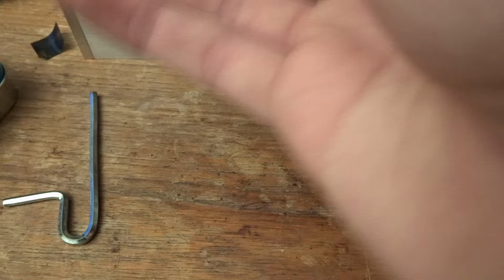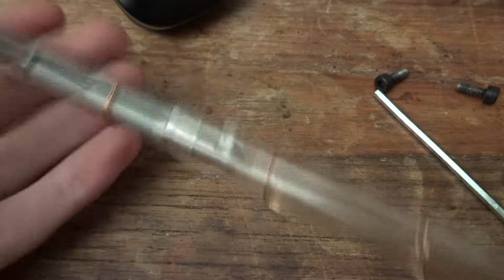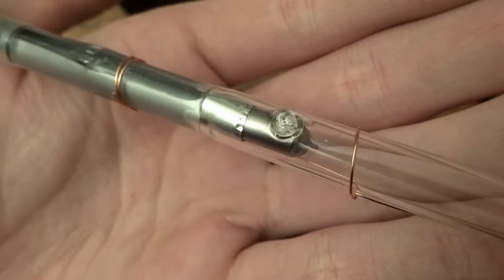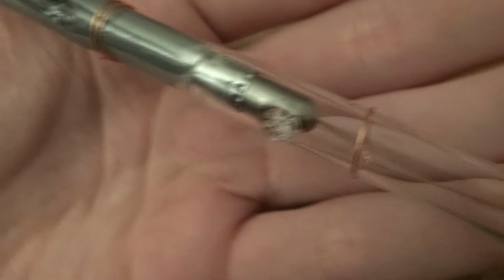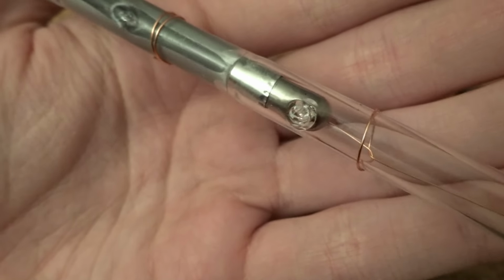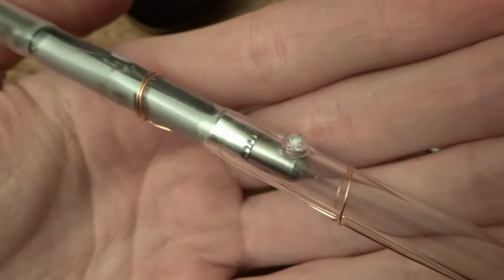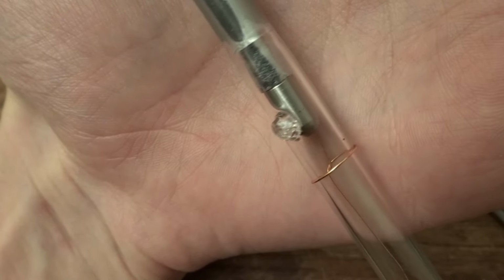The flash tubes used to pump lasers are similar to the ones used in ordinary camera flashes, just beefed way up. To start, they are typically made of quartz glass rather than bog-standard soda lime. This makes them much stronger and able to withstand the much higher internal forces produced when operated at the energies needed to pump lasers. The downside to this construction is the quartz glass passes some ionizing UV radiation that soda lime blocks. Though some do use special quartz glass that blocks it, so just keep that in mind.